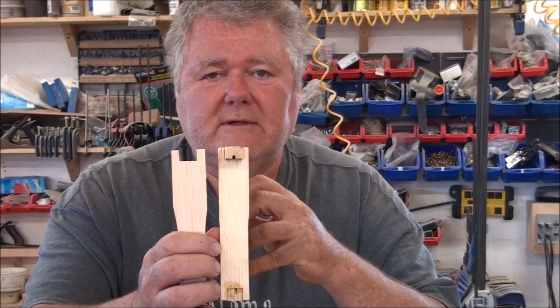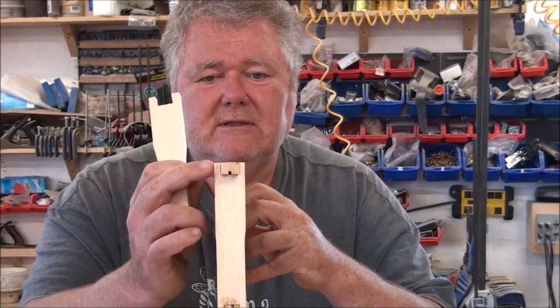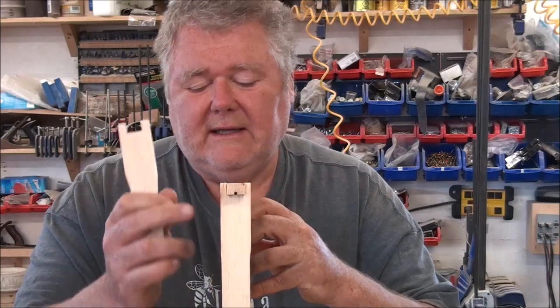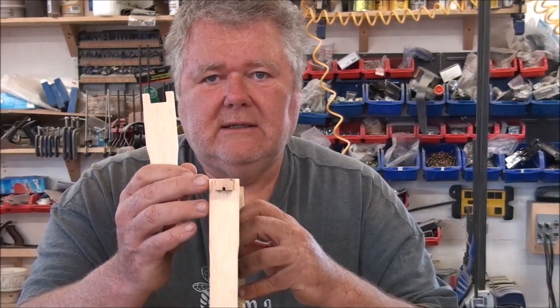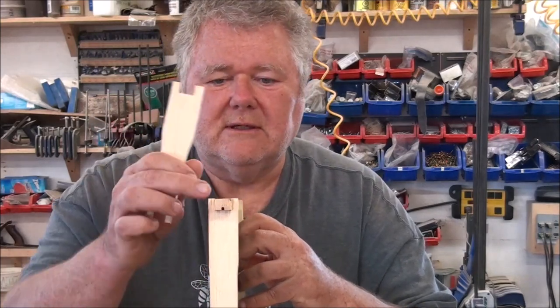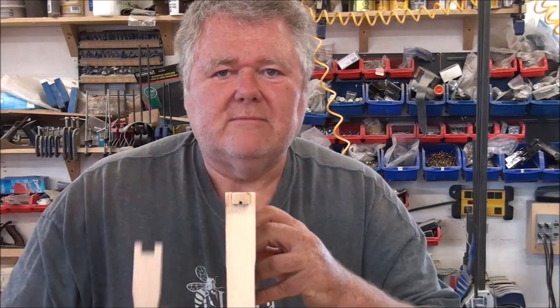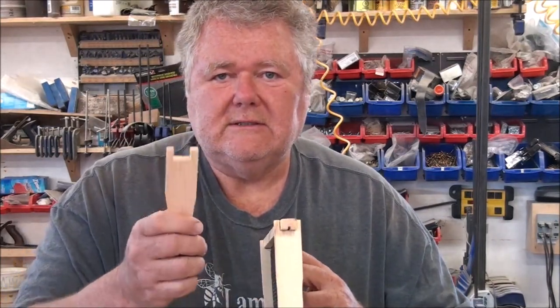And it's a very, very slight difference. It's 1/8 of an inch, 1/16 of an inch off each side, and that's the trick. I can't just cut one side easily through the table saw to make 1 1/4, because then my groove is not going to be in the middle. I can't just cut these on the table saw and take 1/16 off and then flip them over and take another 1/16, because then I have to adjust the fence.